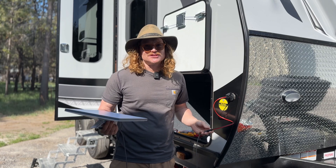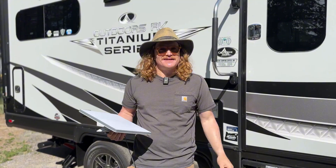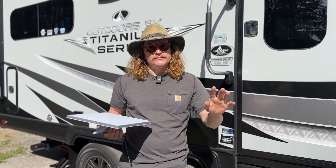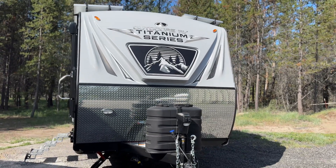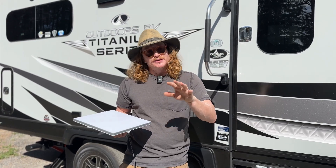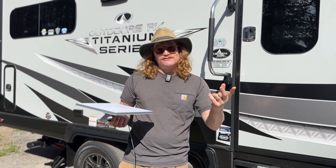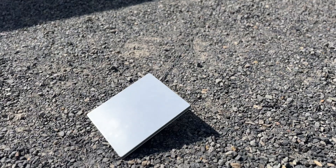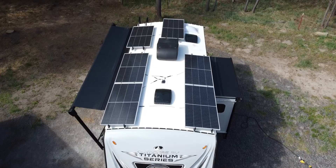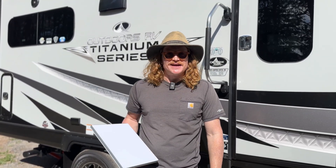This is an awesome solution because we've got the high voltage we need, we could put a longer Mini cord on if we really needed to get away from trees, and we wouldn't have to worry about voltage drop. There's no clunky power brick, and we're not putting a 120 volt power brick outside which could be a little dangerous — keeping it all DC is definitely a lot safer and very streamlined. Thanks for watching, guys. If you want a clearer explanation that's a bit more succinct, let me know in the comments. I'm always going to suggest using your meter to verify every step, because giving generic instructions over the internet doesn't always work out. Let me know if you have any questions, and if you're using the Starlink Mini — I think it's pretty awesome. This customer has 1500 watts of solar on the roof and they're running this super-efficient internet solution. Cheers guys, don't forget to subscribe.